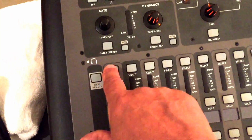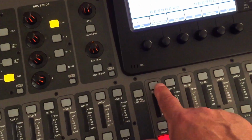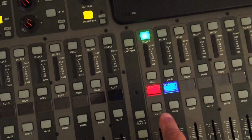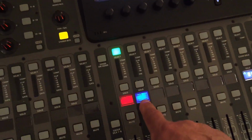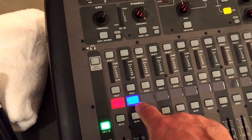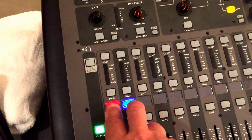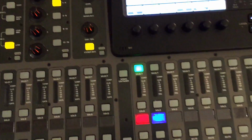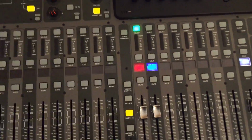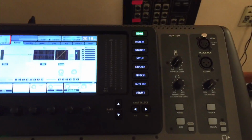And again, channel 1, channel 2 aren't stereo. So the only thing that feeds the house at this point would be subgroup 9. So again, from the generator, subgroup 10, channel 2. Channel 2 waits for the kick drum mic, which releases its signal plus the kick drum back to subgroup 9, and from subgroup 9 it feeds stereo left and right. And this is how we facilitate the aforementioned.